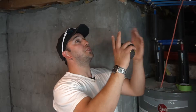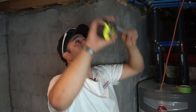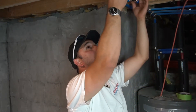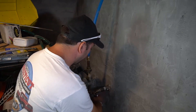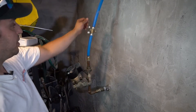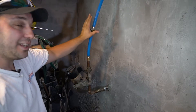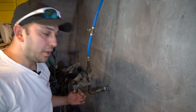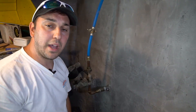We're back down in the basement. We're going to be installing a filter for this homeowner. This is the general area where she wanted it. I've got 16 inches of pipe here, so there's plenty of room to cut out and make this work. This is where the water comes into the house — through this pipe, through the horns, through the meter, and back up into the house. This customer has an isolation valve, so we'll just close it off there. If you didn't have that, you can also shut it off at the isolation valves on the meter.